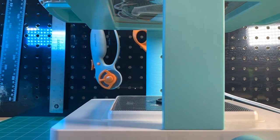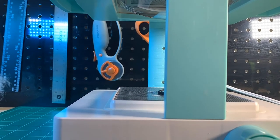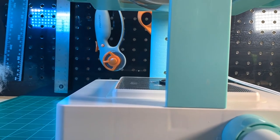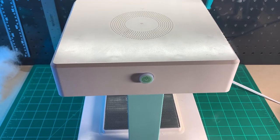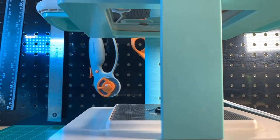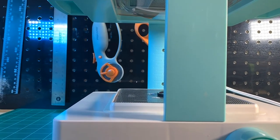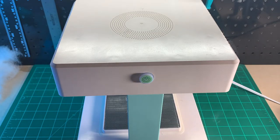What is the droop height? As your plastic heats it'll begin to droop — it'll be wobbly at first, then eventually smoothing out. When it smooths out, that means the plastic has a smooth and even heated surface. For a super shallow object, the second your mold press has a fairly even droop — meaning all the wrinkles have gotten out and you've got a nice consistent droop — your plastic is heated evenly and is ready to go. If you let it droop even a minute longer than that, you'll struggle to get a good mold.